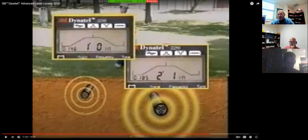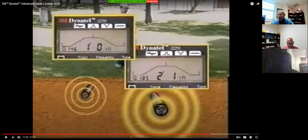When he said measurement of depth, he said it real quick, estimated. It's definitely an estimate. So don't go locating cable, and when it says 2 feet 1 inch, expect the cable to be exactly at 2 feet 1 inch. It might be at 1.5 feet. It might be 2.5 feet. It's an estimate, and especially if you're locating for somebody else, I didn't even give depths. Depths are not required. So out there in the world, be advised, depth is not that accurate. There is a practice that he is using too that I don't agree on, but I'll talk about it later. Go ahead.